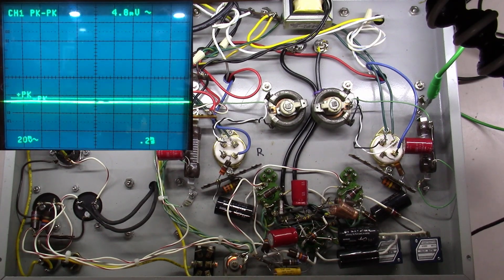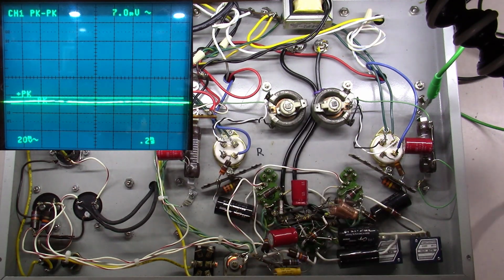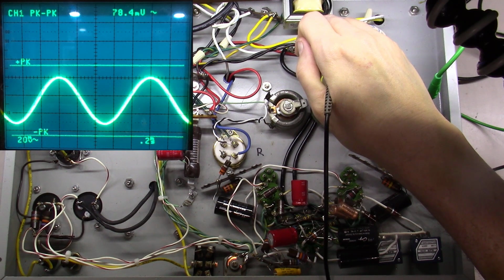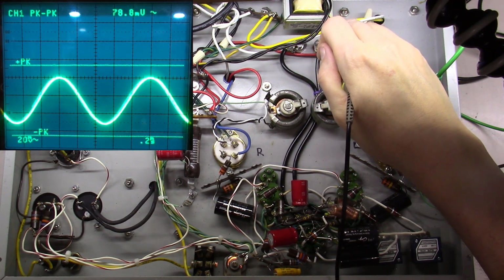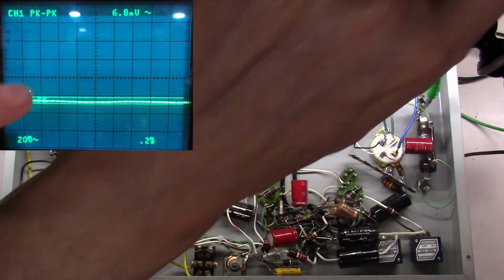Okay, what I've got going on here is nothing more than a standard oscilloscope probe. I've got it on 10x. I've got it plugged into my channel 1 here on my oscilloscope, and I'm just going to start looking for signal. So I've got signal here on the input of one jack. I've got signal here on the input of another jack. What that tells me, all I'm looking for is the magnitude of this signal on both sides is equal, okay?